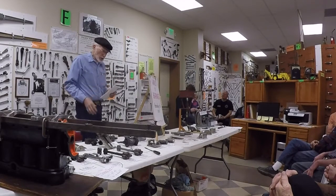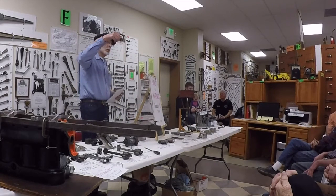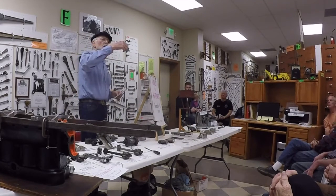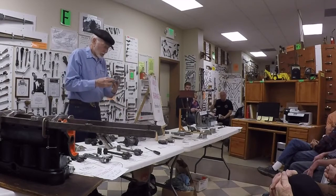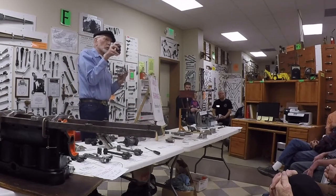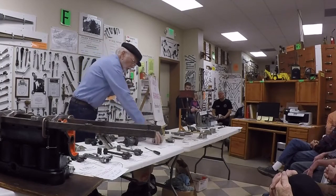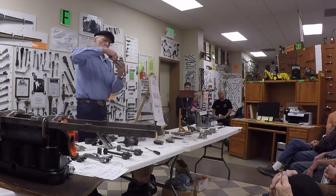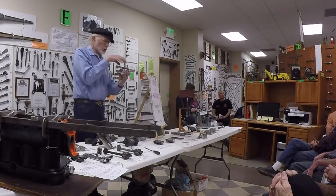Then you heat the pouring fixture. In this case, this is the Model T Ford pouring fixture. I usually date this stuff. I don't see it on there now. Since the Model T rear main has the thrust, it's got a thrust shoulder there. And you always put a little more babbit in there than you need, about 1/8 inch thick. And then I've got a recessed board in there, so when I'm going to do the cap, it goes in here.